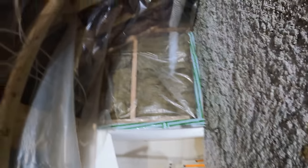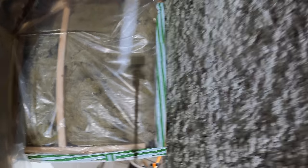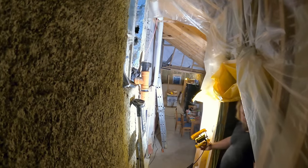Then we have this ducting up here for our mechanical ventilation. So we kind of had to have a little sit down earlier and think about how that was going to work. We have had to join one here, which will come out of Ashton's bathroom. This comes out of our bedroom, or goes into our bedroom, I suppose you could say. Then it follows the line of the wall all the way down where it meets another join here, sent another duct down to that bathroom. And then the whole lot is going to go all the way down to the end wall or end triangle